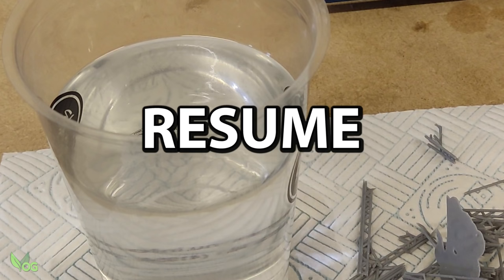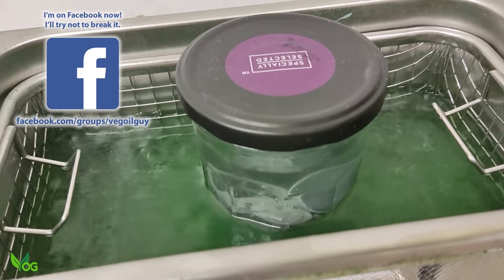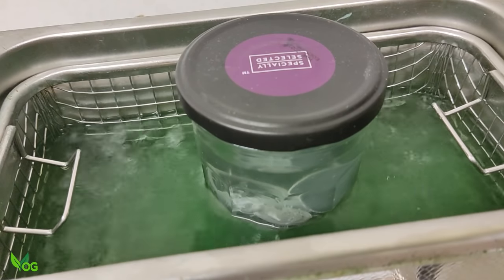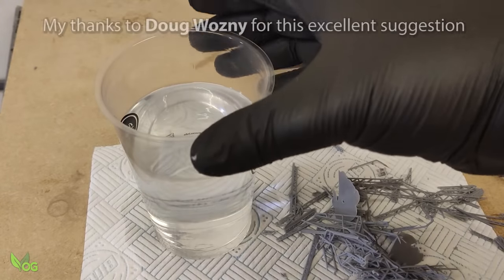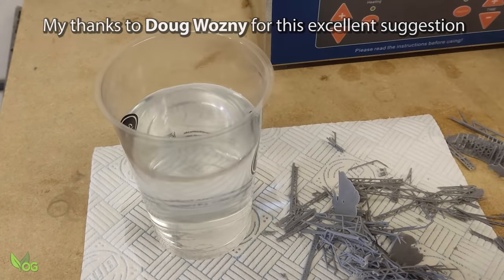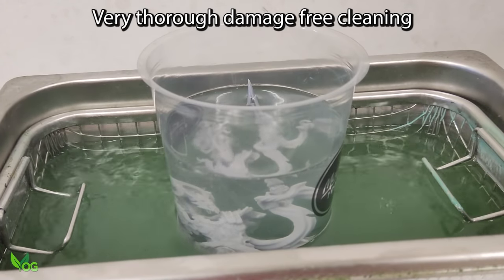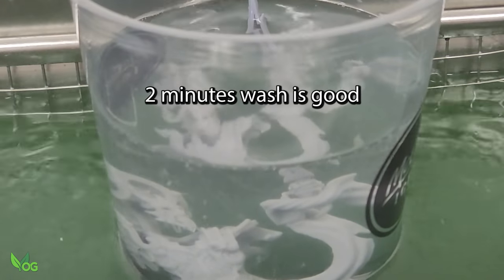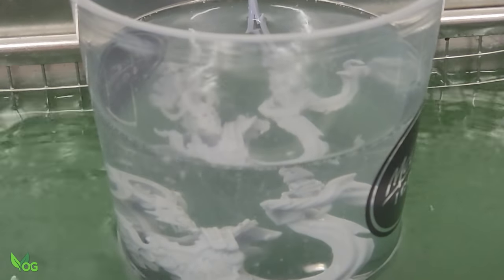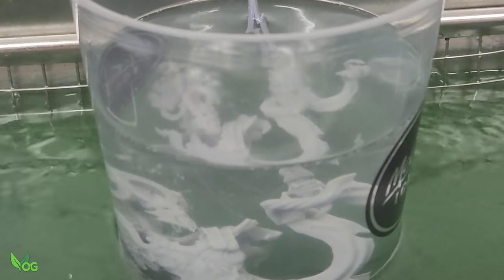And that's what's in this container. Previously I've used a glass jar for this technique, but one of my viewers suggested changing to a plastic container as this allows the vibration from the ultrasonic cleaner to travel through the content more easily. And I have to say, my viewer was right — a plastic container is highly recommended. Immerse the prints and then place them into the ultrasonic cleaner. The surrounding liquid is just ordinary water; there's no point filling the whole thing with IPA unless you're trying to do a larger print. Two minutes in the ultrasonic cleaner makes an incredible difference, probably better than a wash and cure in my opinion, and in many ways it's better because there's no risk of damaging fragile prints.